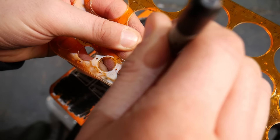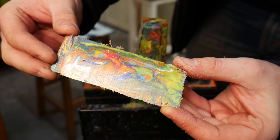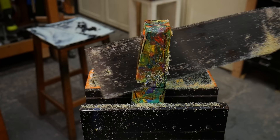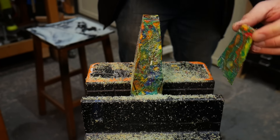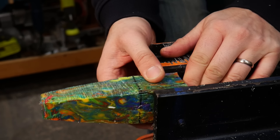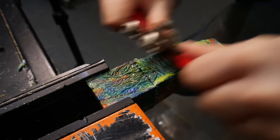At this point it was still feeling quite chunky, so we cut some bigger parts off — and this gave us our first look at some of the awesome marble colors of this multi-color plastic. We also drilled a slightly undersized hole ready for the bottle opener to be screwed in later. We did the majority of the shaping with a spoke shave, which helps soften all the edges and give it a more rounded feel.